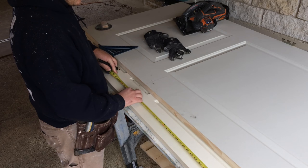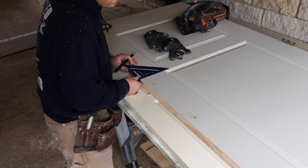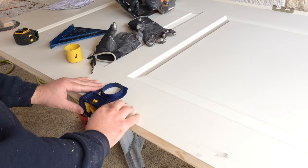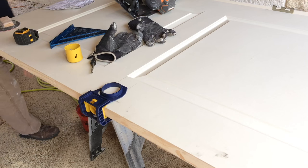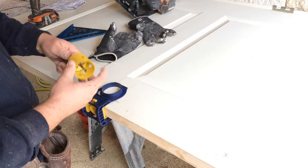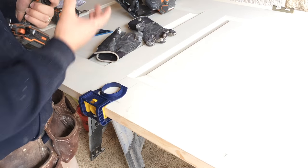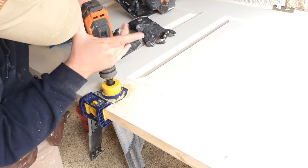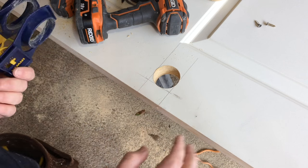Measuring from the center edge of the old doorknob hole and lining it up — your standard doorknob needs a hole two and one eighth inches. The jig slides on to make sure it's aligned; it looks like it self-aligns to the center. I need to put two screws in — I'm just going to thread it on self-tightening so it won't come loose. Once my pilot comes out the other side, I'm going to drill from the other side so I don't have a big tearout.